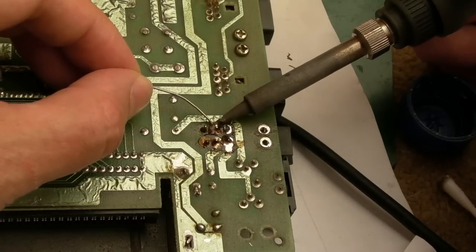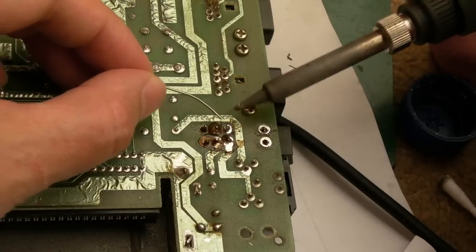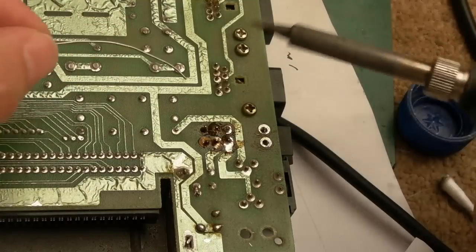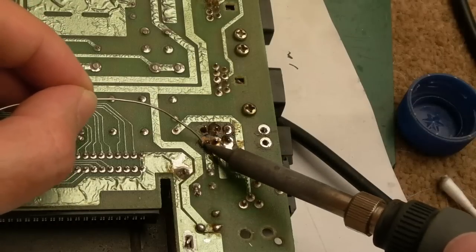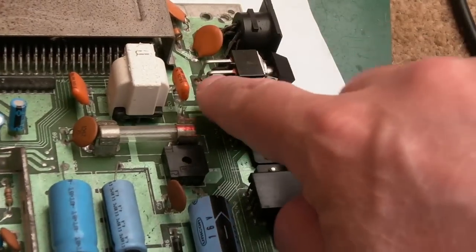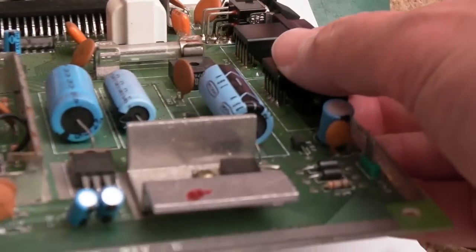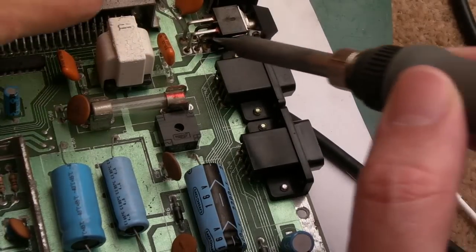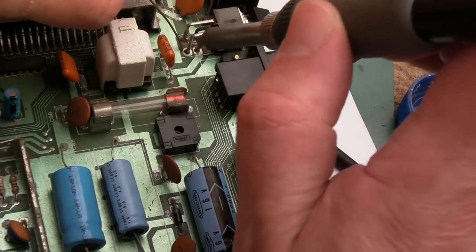Might not matter, that might be the off position. But again, I'm just going to add more to these, because I want it to flow through down the leg and hopefully onto the good six pads on the other side. And you might just be able to see there, the solder has flowed on all those pins there, but not so much, well, none on this first one. Doesn't do anything, but it's anchored there, look.